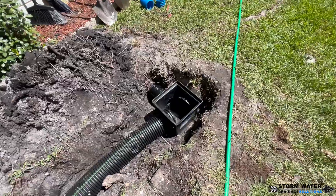Let's take a look at the camera snake footage from my initial assessment of this system. This is directly underneath the sidewalk going into the tree section — as you can see, the bottom of this pipe is completely filled in with roots. As we push further forward it gets to a point where we can't go any further; the roots have totally collapsed this section of pipe and filled the entire thing in. The entire pipe has essentially become a root. There is no jetting this out, there is no snaking it with an auger — you have to replace it. Any company that says they can just snake through that is wrong. This was roughly 30-something feet that we replaced to get the main line back in order, and the system is now functioning very well.